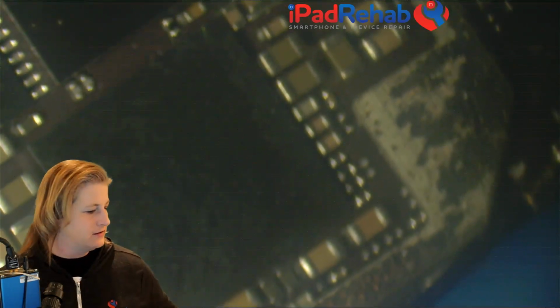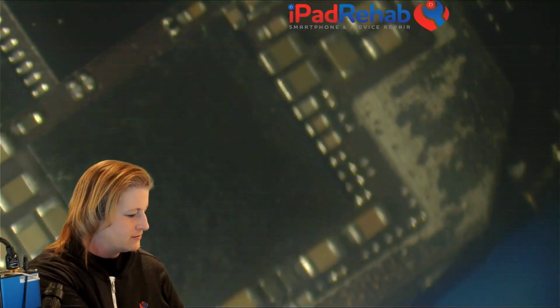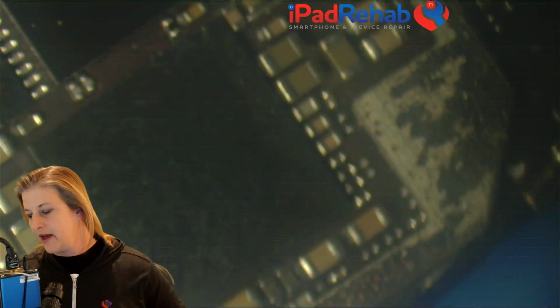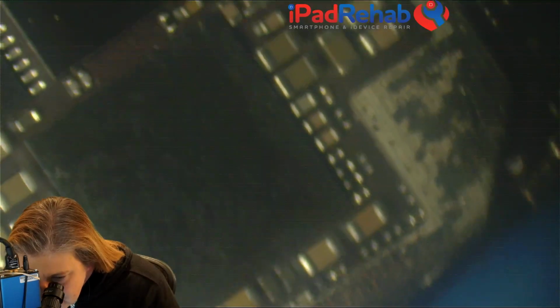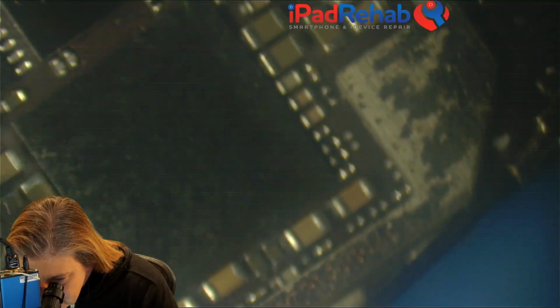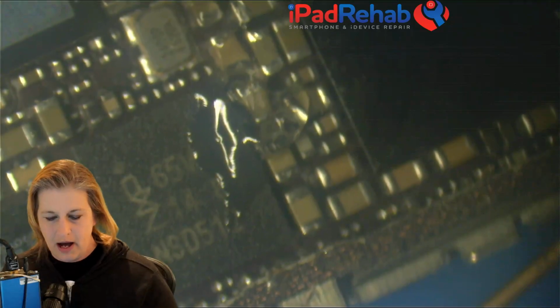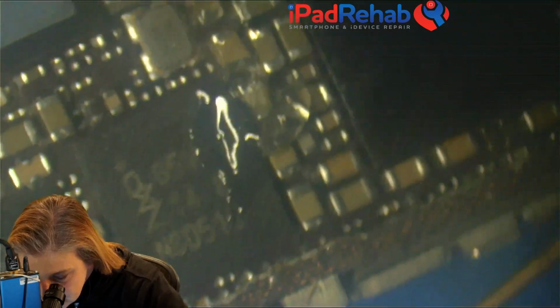So I'm going to use hot air for this rather than my conventional flick off method, because this is not for data recovery. This is for the sake of the phone. And because with only 2 caps on that line, I'm going to put one back, because this is not a VCC main where there's like 38 different caps. So, you know, screw any one cap. This is a charge pump line, whatever that is, and there's only 2 caps on it. They both seem to be pretty substantial, so I would like to replace it rather than just toss it.